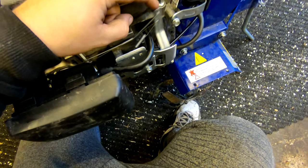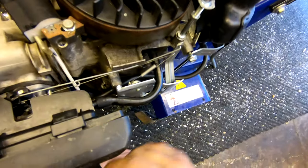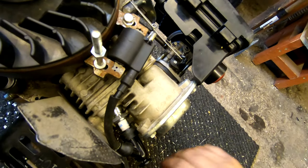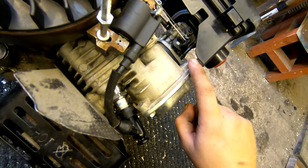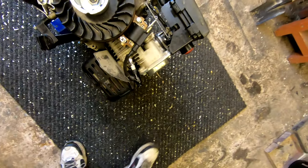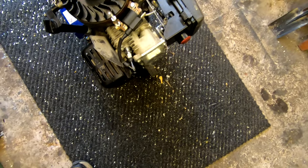Absolutely unreal — and that is the problem I've been having with these. That is how you fix them. From there, this little winding screw just here — it's basically a throttle winder, and it controls how much throttle it actually wants. If you wind it in, it'll whack it up; if you wind it out, it'll wind it down. We're going to try this machine now and alter that little screw to get it just so it's ticking over fine, because these machines don't actually need a lot of revving — you let the machine do the work, don't let yourself do the work for the machine.